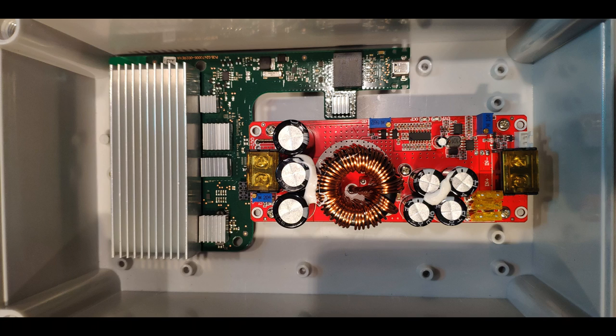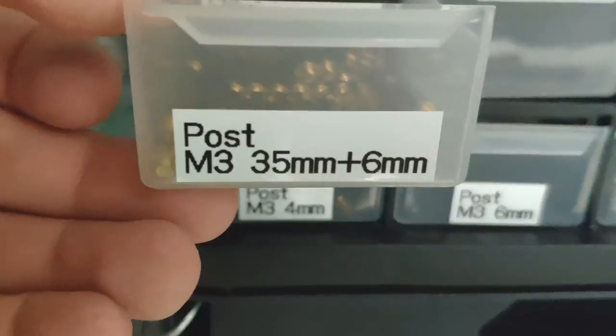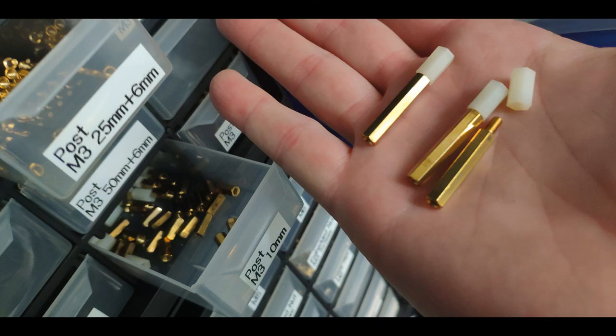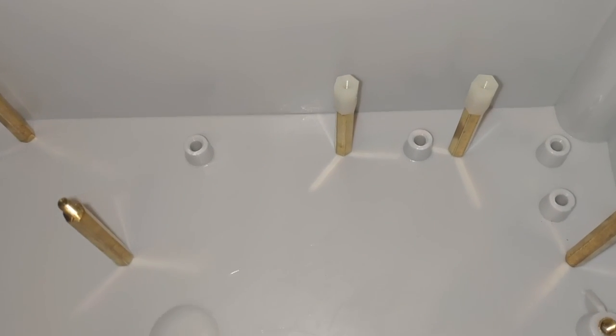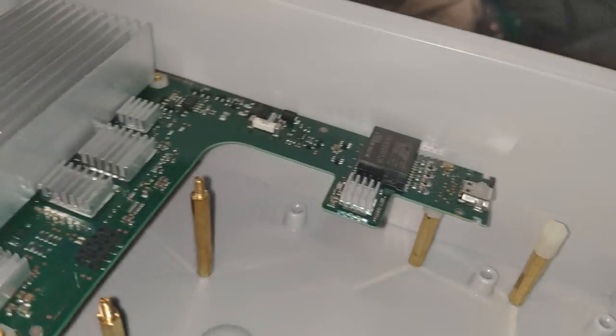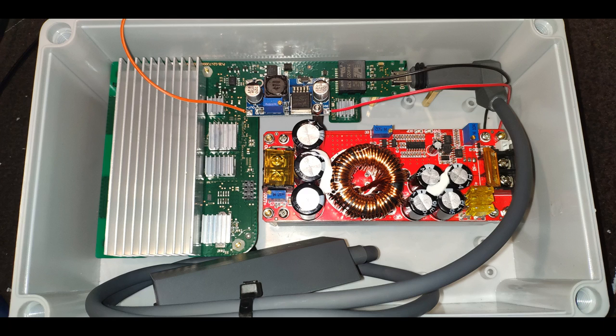This is the basic layout I came up with. The red board is the new power supply for the 50 volt side. I used 35 millimeter posts to support the router circuit board and the 50 volt power supply board, plus some 25 millimeter and smaller nylon posts to support the ethernet connection without causing shorts. Here's the router circuit board installed with a fit check for the ethernet adapter. I drilled the hole for the ethernet adapter connector — it would have been better to drill without components inside, but I was winging it.